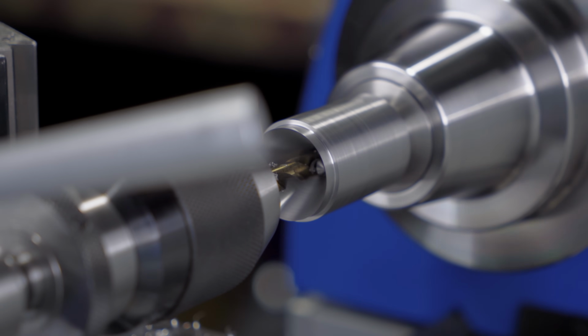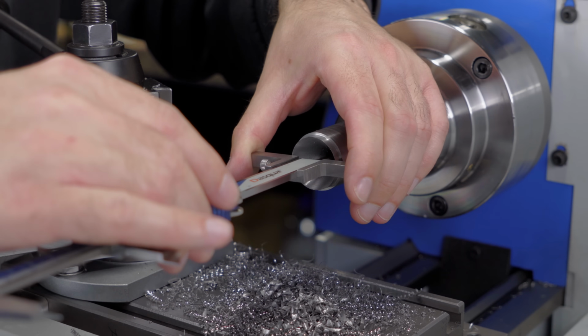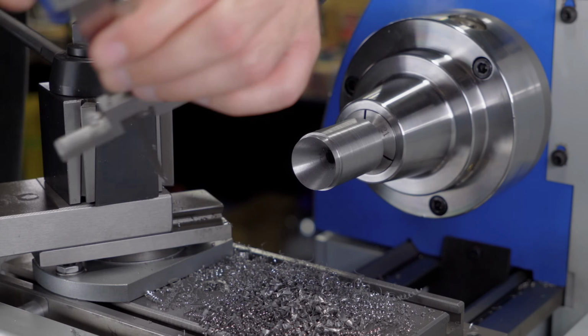This hole is just a clearance hole for now. I'm going to drill this again later to tap M8 or maybe M10, I haven't decided yet. I need to know first if the shank clears the bridges. So before that, let's start making the next part, the cap.